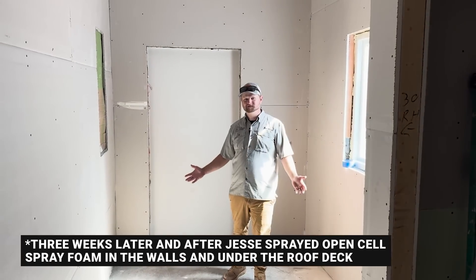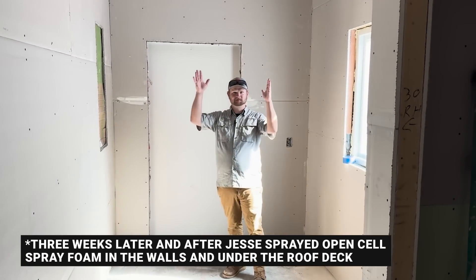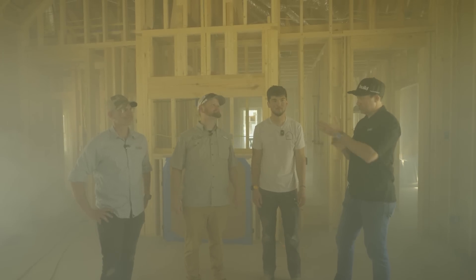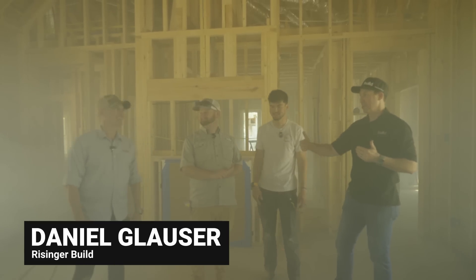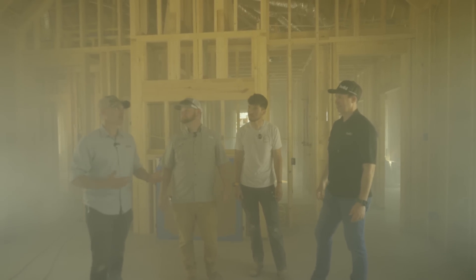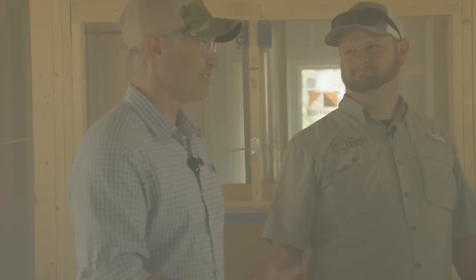We're back at the house. We've got drywall in now, spray foam insulation in, and we fixed a couple of spots we knew had to be fixed. We blower-doored it again earlier today and got 0.6 ACH50 — that is just about passive house level, so we're super excited about that. Let's end the video in the fog. What did you learn from fogging this house? For me it comes down to paying attention to the details. These guys have done a fantastic job with simple attention to detail and great use of products, and it showed in the score.